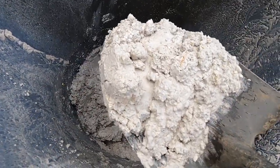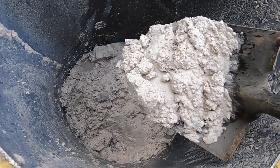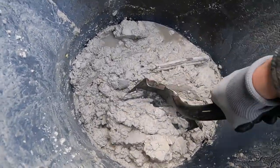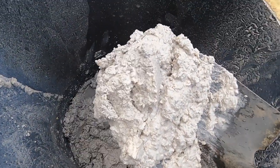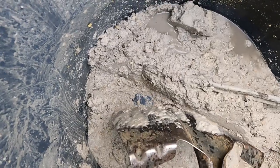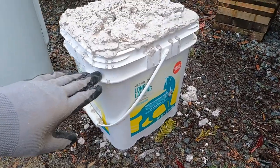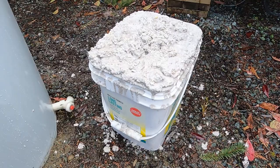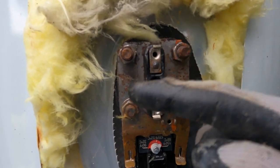I got to take this out with a shovel because it's still so heavy I can't even lift it into the truck. I think this is calcium deposits in here — look at that. Even just that one shovel full weighs quite a bit. You can see the bottom of the tank doesn't look rusty at all. I got that mostly cleaned out but look at that — this bucket is overflowing. I'd estimate that's 60 or 70 pounds. You can also see this has got the old flanged elements with the four bolts and nuts.